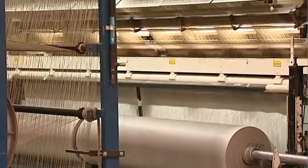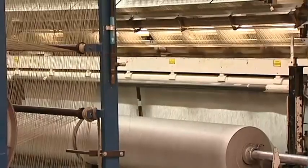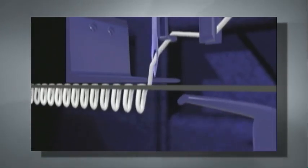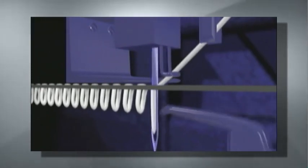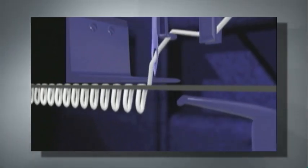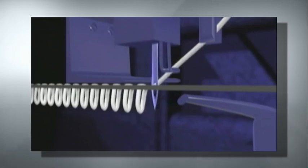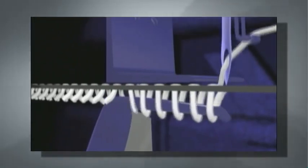The main function of the primary is to provide a base cloth to hold the tufts in place until the coating process. As the needles penetrate the primary backing, a looper is inserted into the loop of yarn formed by each individual needle to hold it in place while the needle withdraws from the primary. The primary advances between needle penetrations, which determines the stitch rate of the product. This process results in a loop pile construction.